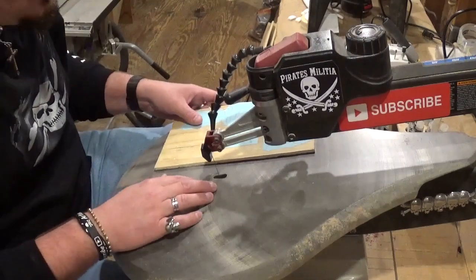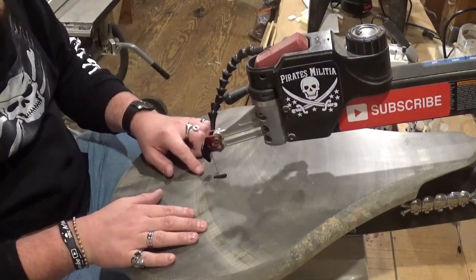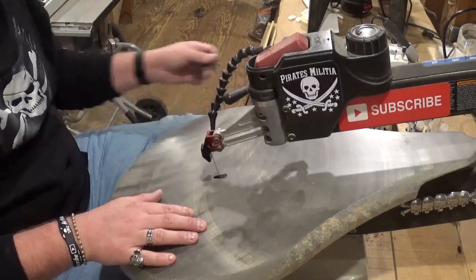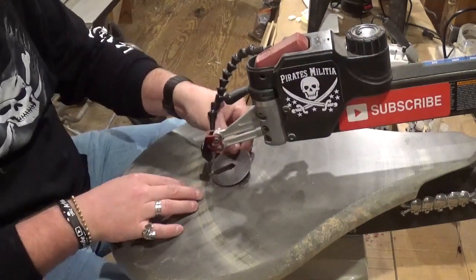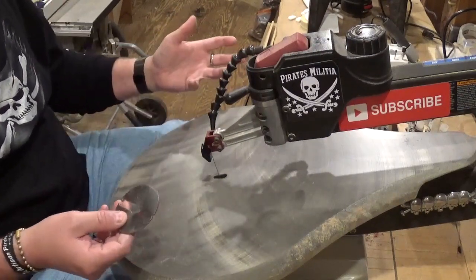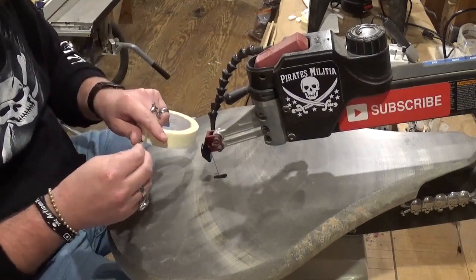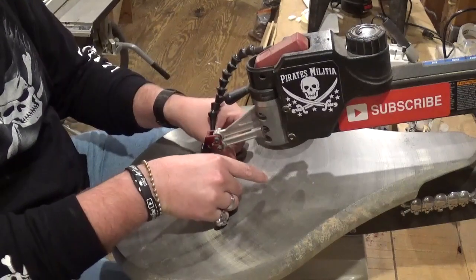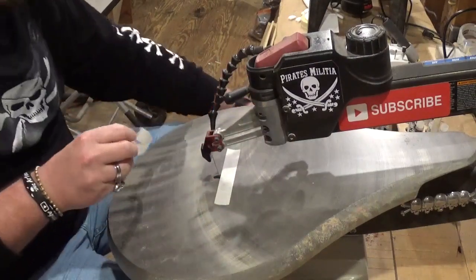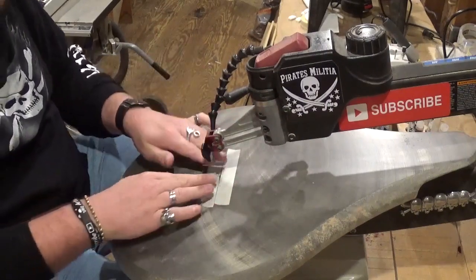Over here at the scroll saw — I hope you guys can see everything clearly. When cutting out small parts, there is a likelihood that the small piece will fall down into the hole where the blade goes through in the center of the table. On older scroll saws some had a plate that made an even bigger hole, more chance for a piece to fall down and get lost in the sawdust. What Steve Good suggests is to put blue painter's tape — I'm demonstrating with masking tape — on your table. It will not leave residue. Just put it here and here, and now when you cut out a small piece it has nowhere to go but pop back up out of the waste wood.